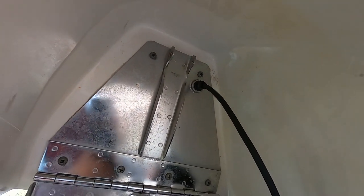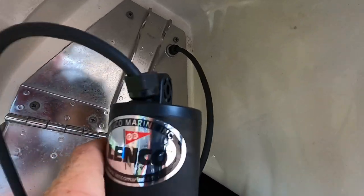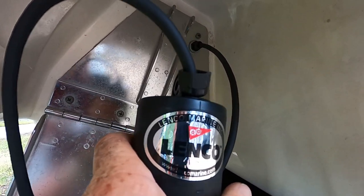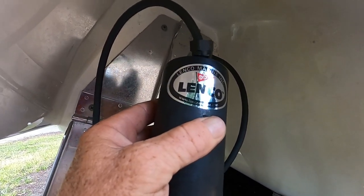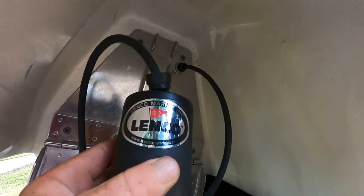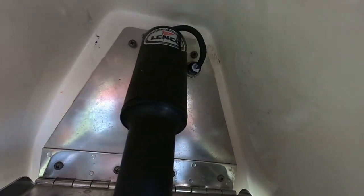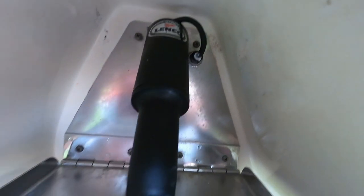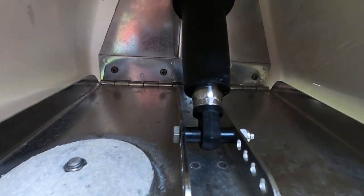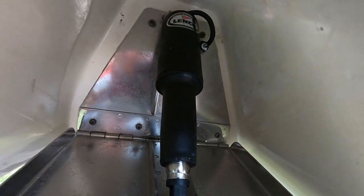Time to put this back in. I'm going to make sure it's the right way before I put it in and line everything up. I got the new one on. I went ahead and put a little bit of 5200 up in there before I screwed it back on, just to make sure I got a good seal and don't have any water leaks. Put the new bolts and nuts, everything back together, and I'm going to go in and put the wiring together.